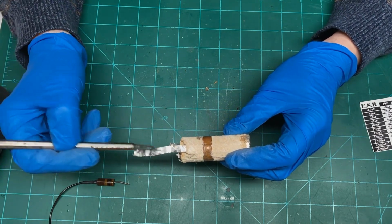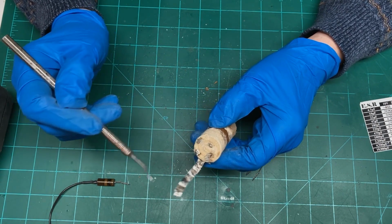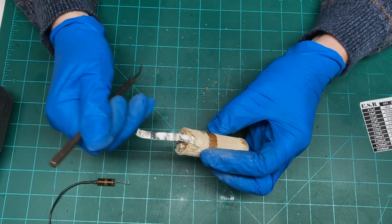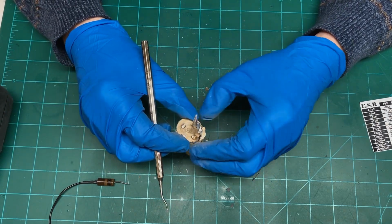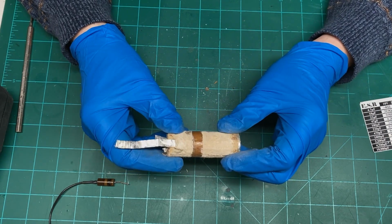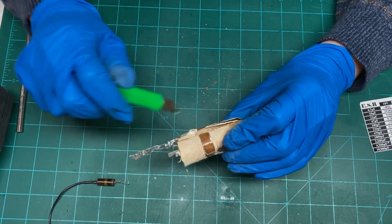The one good thing about having that done is if your filter does short out inside, if this little jelly roll just develops a short, sometimes they'll go open because they have blown this connection off, and that will save either your rectifier from blowing the bonding connection off the inside of your rectifier, or your transformer. And in some cases that transformer is made out of unobtainium, and you're not going to find another one very easily. And so it's one good thing about a capacitor going open, but unfortunately probably 50% of the time they go shorted. So anyway, I wanted to show that to you, and let's just slice this thing open and see what we can see here. Looks like they used a little bit of tape originally to, oh, they did, okay.